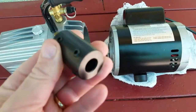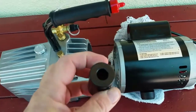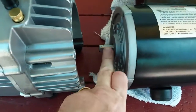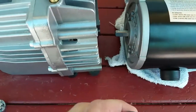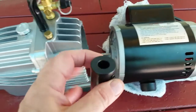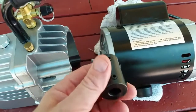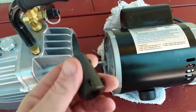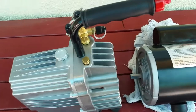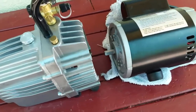So what people use is a round, they call it round shaft, even though the shaft's not really round. They consider it that. The problem with this is, though, sometimes they get loose and they strip out the flat, and we've all seen that, right? If we work around this kind of stuff at all, like fan motors. So the torque capacity of this, we had to figure out, okay, what is the torque rating, because they specify these in terms of torque, and this one's about as good as it gets because it's solid steel. It has a torque capacity of basically 20 foot-pounds. At 235 inch-pounds, it was about 20 foot-pounds.